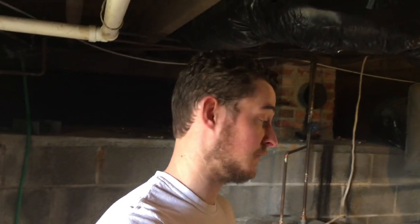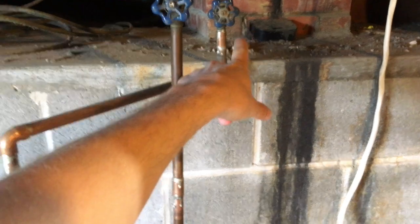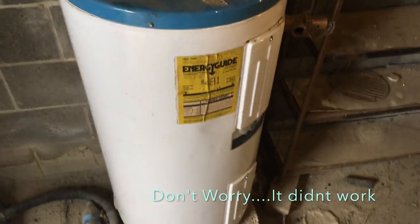This is obviously my first time and I'm not sure how easy it is to drain one of these things. I think what I'm gonna do is turn the cold valve off, leave the hot valve on, and run all the hot water out to see if that works. There won't be much flow pressure, but hopefully it'll ease up some of the residual in the tank so it'll be easier to move and drain — because I'm down in the cellar and it's gonna be hard to pump it up over that wall.